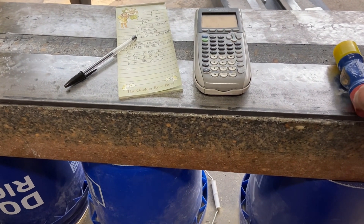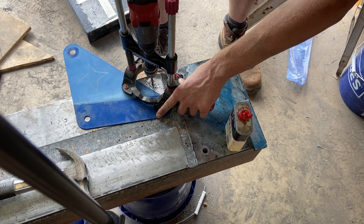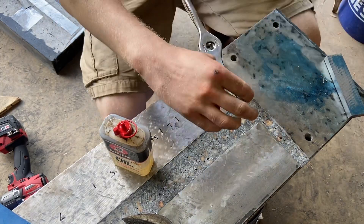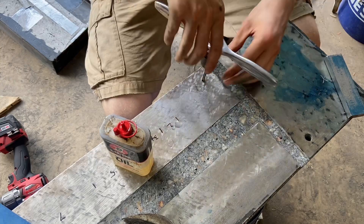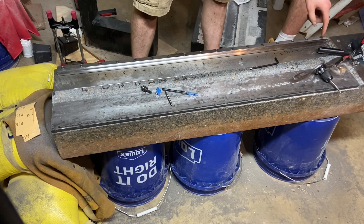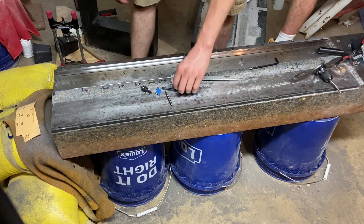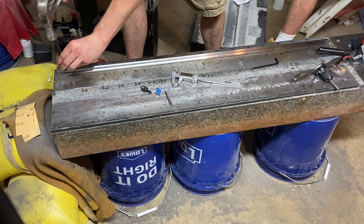I'm not going to fully bolt it down and straighten it, just getting the mounting holes in place. The first bolt is now in. I've got it centered as best I can with the bolt in the center of the hole, and I've got a caliper measurement on that side that I'm trying to transfer to the other. Now I'm going to transfer punch the second hole, and hopefully that'll give me a decently aligned rail that I can put the center holes into.